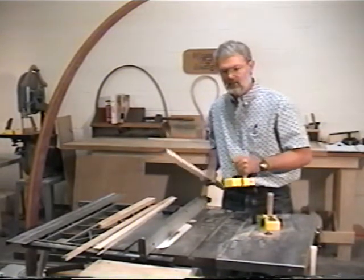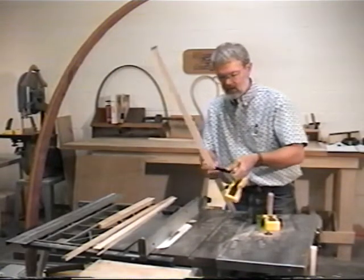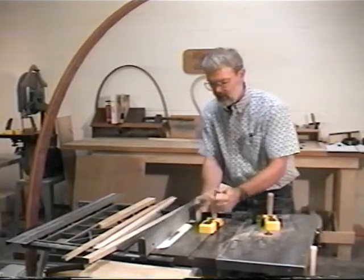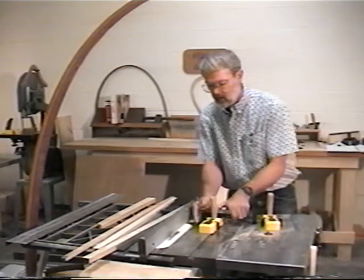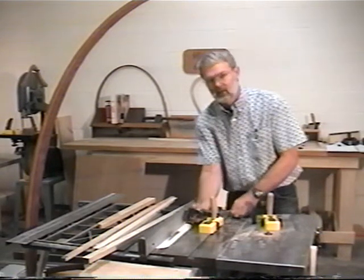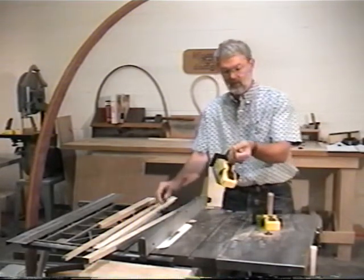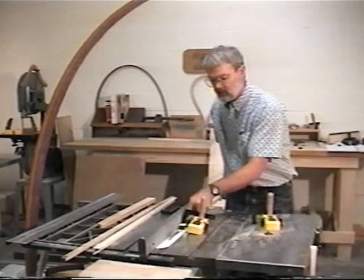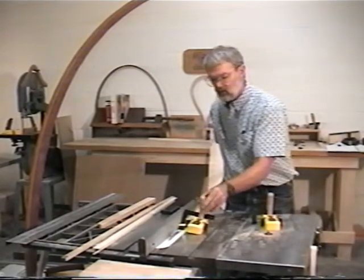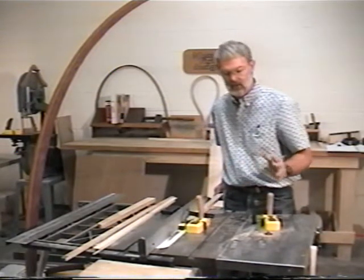The easy way to set a Grip-Tite up is to move the L in for thinner pieces because it holds really, really tightly against kickback. Move it out for thicker pieces like 2x4s. This is a 3/4 inch one, so I'll put it about 3/4 inch out. Just set the L fin on the wood, bring this back and touch the wood and help it snap down. That's all there is to it.